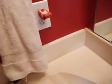So there's a GFCI in the guest bathroom, and again we've not reset it, it's not working. Now it could be another GFCI is around somewhere and I can't find it. It can happen that way. We have two outlets inside the cupboards here. There's no great shakes to that, that's good. The only problem we got is they aren't resetting. So I would say you're going to need new GFCIs fitted to the board, or them swapped out, and rather than putting GFCI breakers in, just put GFCI outlets into here.